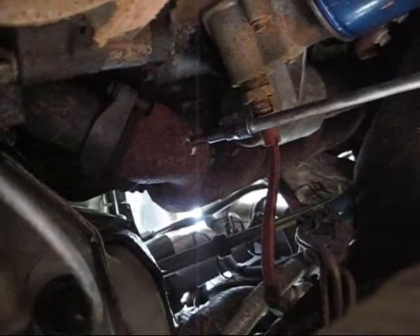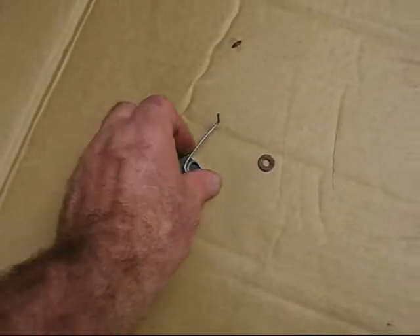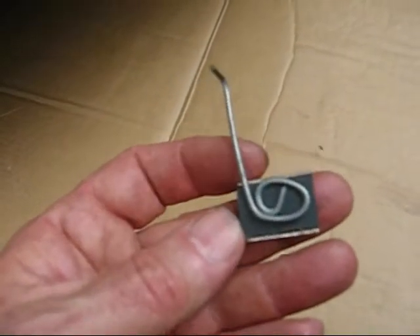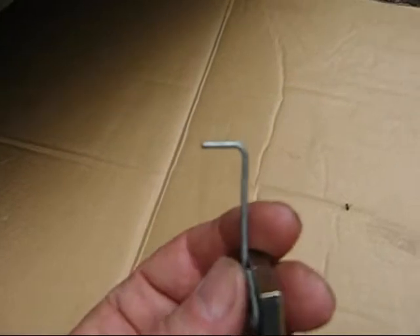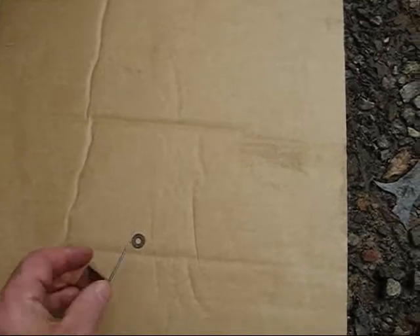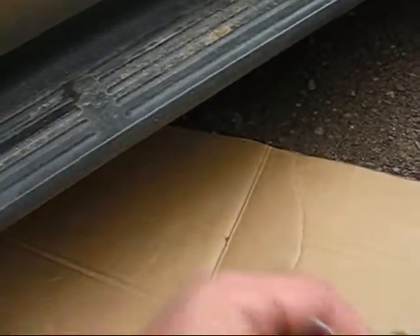I'll sign off for now — I've got to fish out the metal crumbs after tapping. The holes actually drilled surprisingly easy. According to the directions, you're supposed to take a magnet and fish around inside the hole up in the exhaust pipe to get any shreds of metal. I didn't have a magnet that would fit, so I made something — I took a piece of steel wire, coiled it up for good contact surface on the magnet, and bent it so I can stick it up in the hole and fish around. That should pick up any metal that's in there.